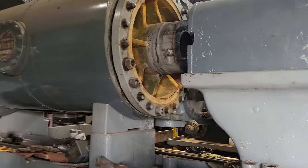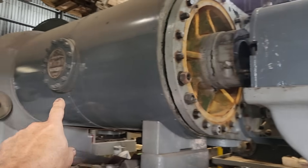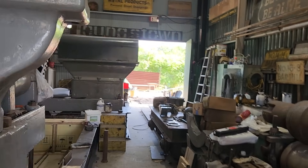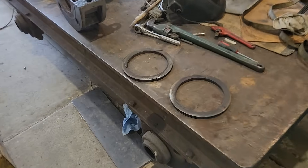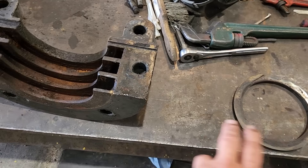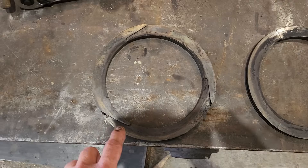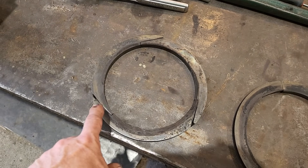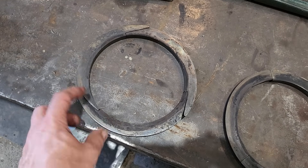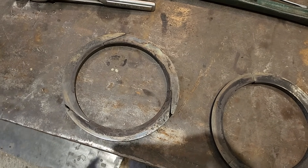One of those parts is the mechanical packing that goes up here where the piston rod comes out of the head, and then there's another one at the other end — they're identical since this one has a tail rod, both sides are the same. These are the actual packing; those two segments go together and fit in one of the grooves, and there are three sets of them. This is called a tangential ring. When they're in place there's a little bit of a gap right here — they're not up tight. There's a spring holding them together, and as these wear they close in until they're pretty much worn out.